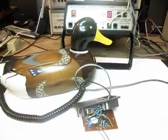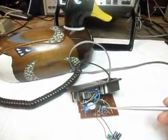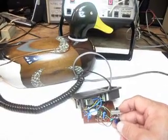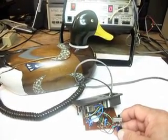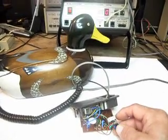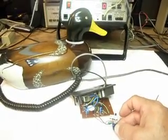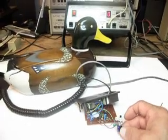What we have here is I've gone ahead and went through the circuit board and replaced some components, made sure everything was up to value. We have a switch here with three different sounds, and one of them is going to sound like what it did when it came in, only a little faster and not so sick. Some may say they all sound sick, but that's basically the fallback to the way these ducks sounded. That's the best way I could figure out how to let Jennifer hear it for herself and maybe pick one of these sounds that she thought was best.